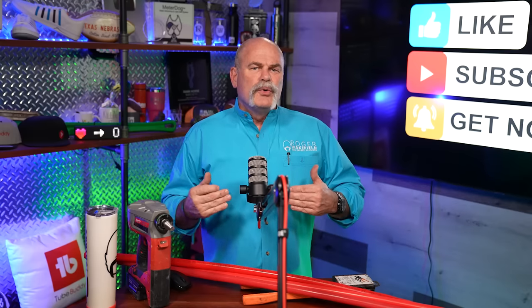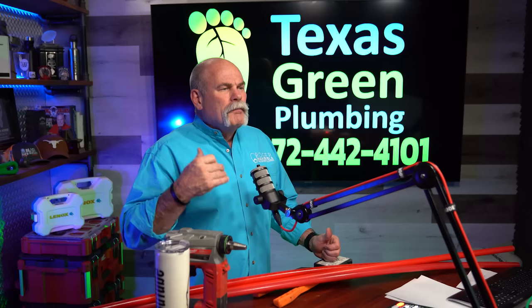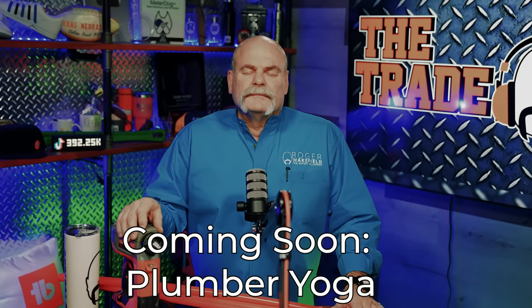How do you know the difference, and is that really important? It may not be very important to you, but if you're a homeowner, you need to think about it — what are you paying for and what are you actually getting? Because PEX-A is more expensive than PEX-B, but it also has good things about it that make it probably more worth it. PEX-A is actually more flexible and more expandable, so if you've got PEX-A in your attic and it gets really cold, you don't worry as much about it freezing. It could still happen, but PEX-A has more flexibility.